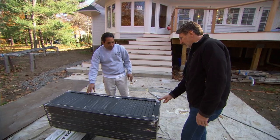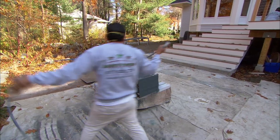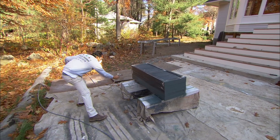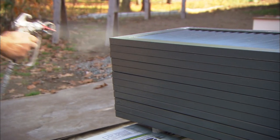So what's the process here? We're going to use an airless sprayer, and we're going to spray this tinted primer 90% closer to the final color. First thing we do is spray all the four sides, and then we spray the top. So that's why you've got these all stacked up nice and even — you can spray the edges on a whole bunch of them all at one time.